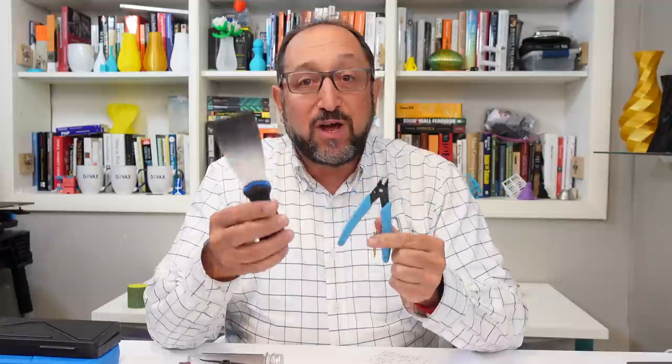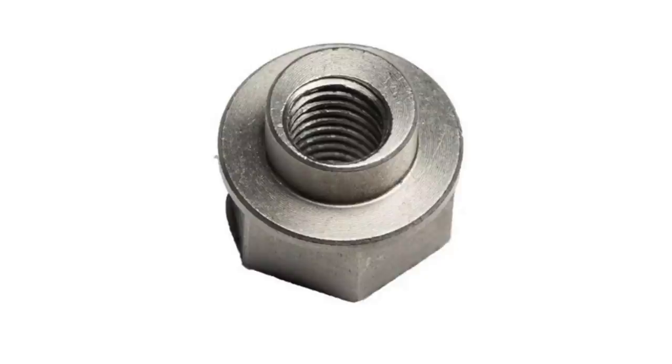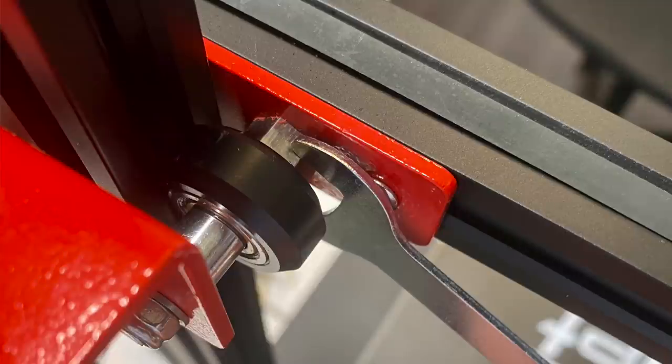Let's start with a couple that aren't on the list. Every 3D printer comes with some supplies — don't lose them, use them. You're going to need a scraper of some type to get prints off the print bed. If your printer did not come with a diagonal cutter, go out and buy one; these are under $10 online. You absolutely need one for cutting your filament at an angle to feed into your extruder and for cleaning up prints. Your printer may also come with a wrench used to adjust eccentric nuts — nuts where the hole is off-center — which you use to adjust the wheels for your X and Y carriage.